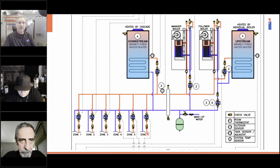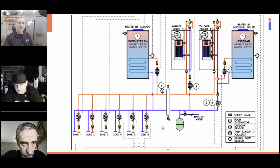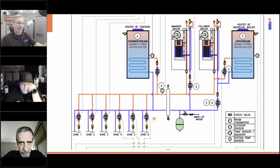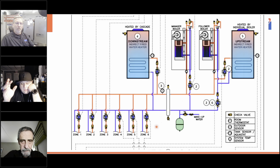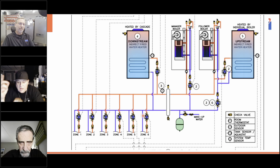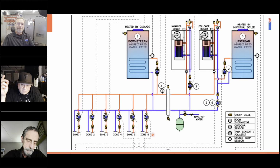If you had, you could have eight zone valves on each one of these. Absolutely. Yeah, that's what I'm saying. So you're really not limited to six zones here. You're limited to six circulators. Completely configurable. That's right. This is the good thing about the TFTN: you've got the features where, number one, you do your delta T, time the pump. You're going to give it priority settings.